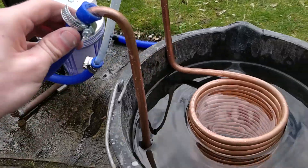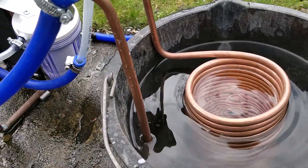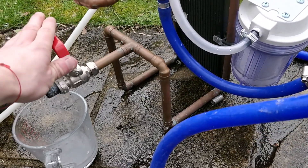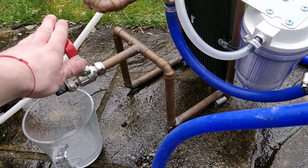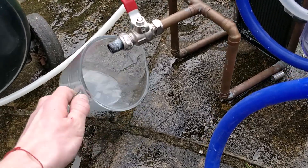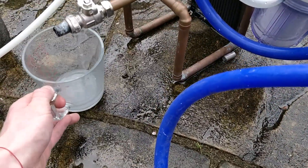The gas then travels through this pipe into this cooler — it's cold water — so it's going to be hot on this side, cold on this side, and then runs into this system I've made here which just bleeds the pressure if I want to stop the reaction at any time. Any pressure or water from the chemical reaction can travel through all this pipework and come out on this side.